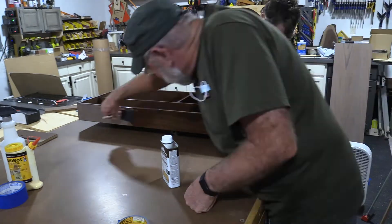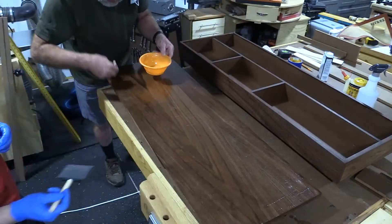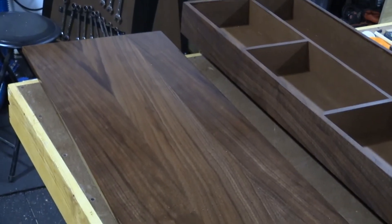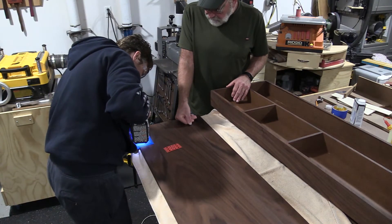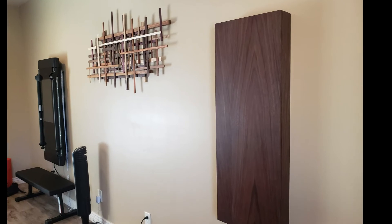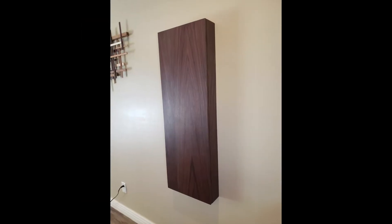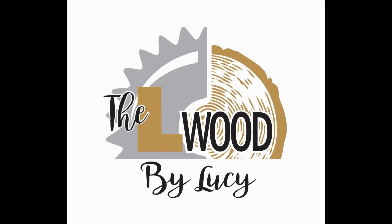For the finish we used Danish oil, and after that set for several days we put some paste wax over it, which gave it a really nice deep natural look. Prior to working with this walnut I never really understood the color difference between air-dried and kiln-dried walnut — just how deep and more red and orange the air-dried walnut is. This stuff is really very beautiful. We installed some soft-close hinges, then installed it to the walls and filled it up with the Tonal accessories. I'm very happy with this project and we both learned a tremendous amount with our first time using the domino as well as the vacuum press. I will definitely have more veneer videos coming, so if you are enjoying my work please like and subscribe and follow along as I hopefully continue to learn and grow.